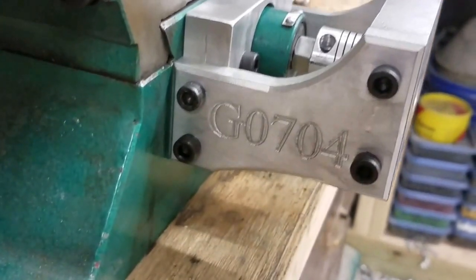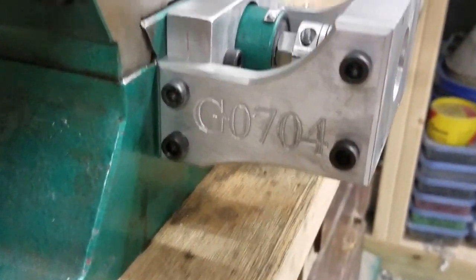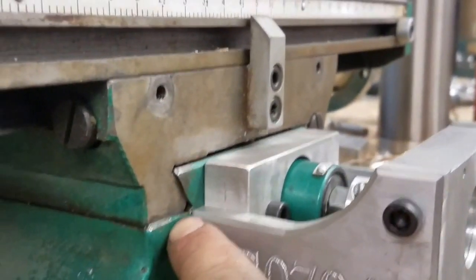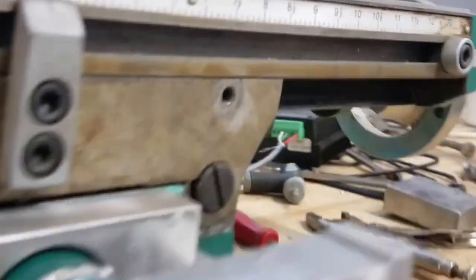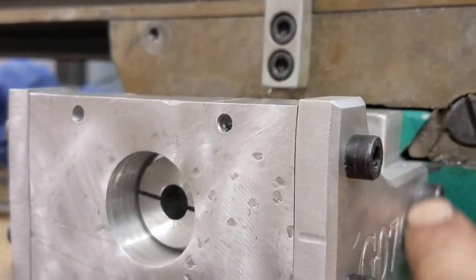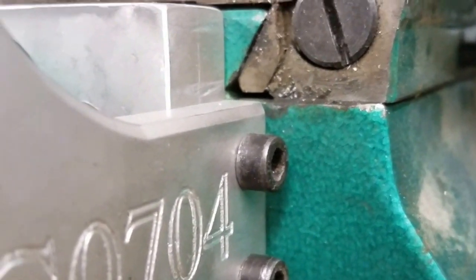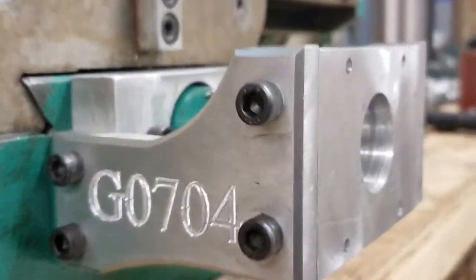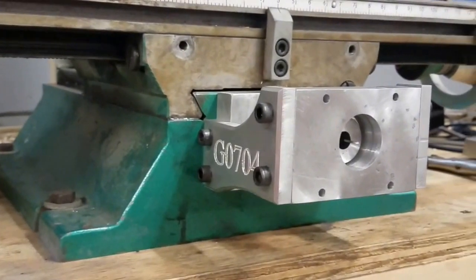This is just to get me started. I made that bracket a little fancier than needed, but it's a funny shape — it couldn't stick up past here because of the way the Gibbs travel out and slide right over it. So it had to be shaped like that, and as I mentioned before, the motor has to be in line. Everything's looking pretty good.